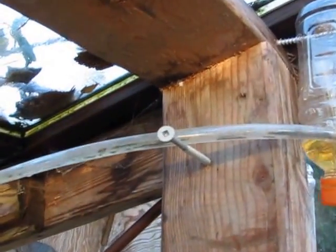The speed is slightly variable because you get an air bubble in and then the air bubble will go through. The first one is still a little bit locked up. The air bubbles will come along, and when they get to this one here, the air will bubble out and it'll speed up. And then everything slows for a minute, then it kind of jams up again with air bubbles and slows down. That'll mean everything goes all the time at slightly different speeds.